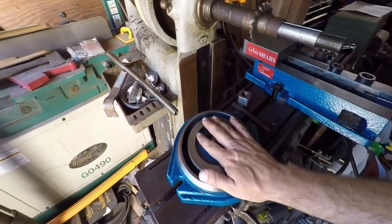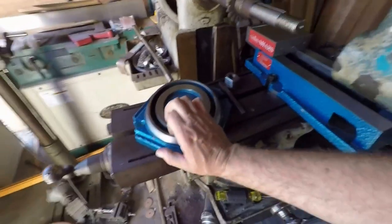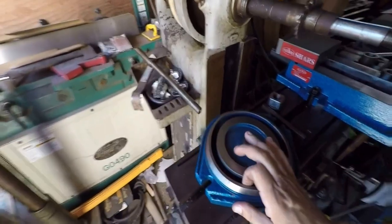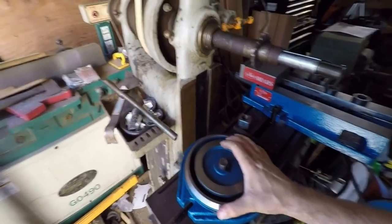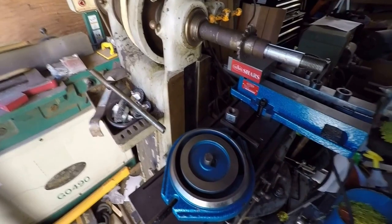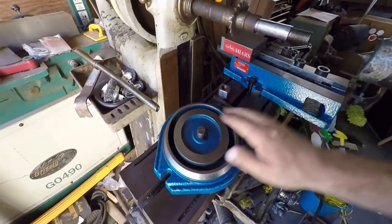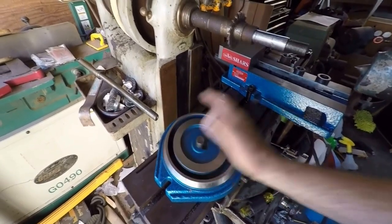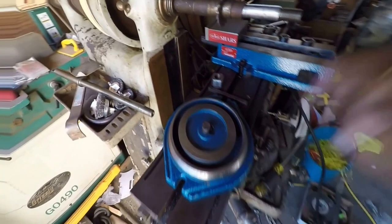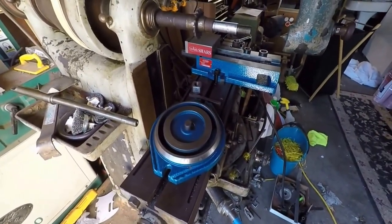Oh, tram in the vise while it's sitting on this plate. They've got key plugs on this thing here, and boy, they fit pretty good. That's not even bolted down, but it's that part they did a pretty decent job on. There's almost no movement there. So I don't know. Maybe it's better that I put my zero mark in once I've got the vise trammed. And then it'll be right on for my machine, because who knows how much care they're going to take over in China.